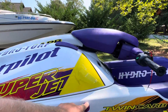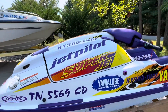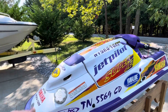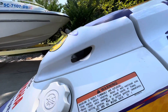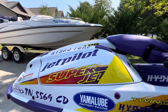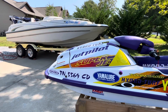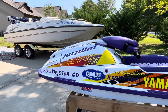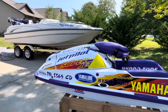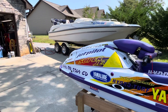I'm guessing they added this right here, which is the bilge pump — it does have a bilge pump in there, and I'm pretty sure that's aftermarket. This is a pre-mix as you can tell — it's a 50-to-1. There's only one tank in there which is the gas tank, and they pre-mix 50-to-1 with TCW3 oil. That's what it's rated for. The fuel storage is 4.8 gallons, so there should be plenty of room.